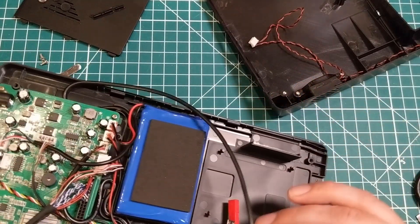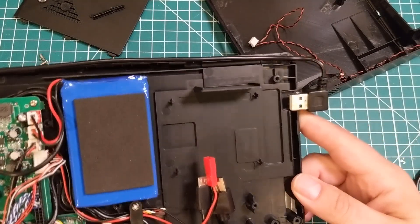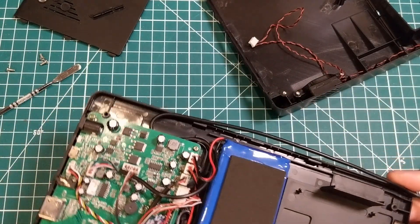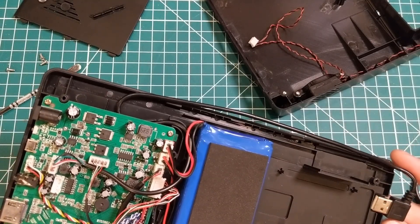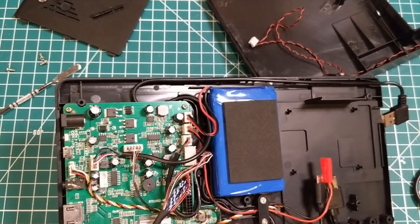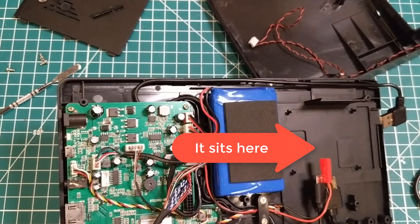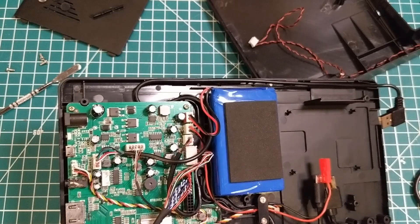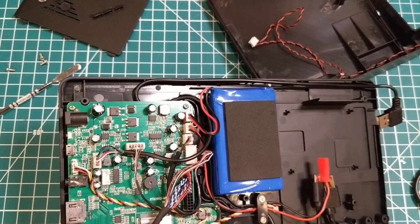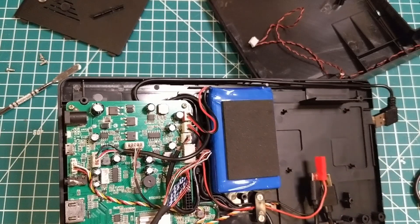The other thing I noticed is this is your touch screen cable right here. You could tuck it somewhere in here and get it out of the way if you decide to forego the touch screen for a more streamlined approach. I wanted to pause and note that — I'm not an engineer — but it looks like there would be plenty of room to turn the Pi 90 degrees and use some kind of breakout headers to run those ports along the side, even if you only wind up with two USB ports on the side and steal one internally for the touch screen. It seems like there would be a lot of room to get that USB touch screen cable inside without running it down the outside of the device.